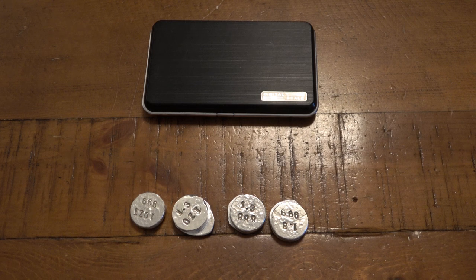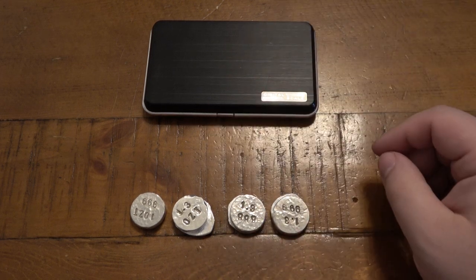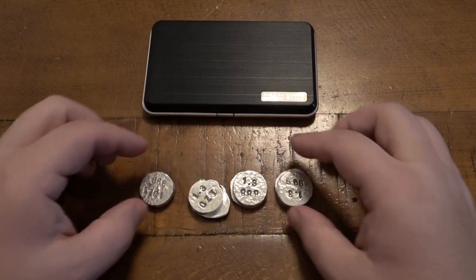My issue here really was the small mold - it was a one-ounce mold, I believe. When I did a practice run I put solid silver shot in there and didn't factor in that obviously there's a lot of empty space between pellets. So when I put a full ounce of melted silver in, it didn't dawn on me that melted silver takes up a much smaller space. That's where you learn things. This is my very first time and I feel like I've learned a lot. Going into round two with some different molds, I think it will come out awesome. I'm still very happy with my first couple of attempts.